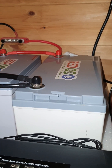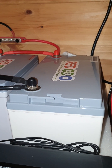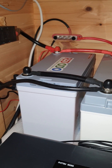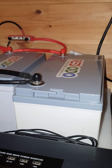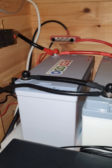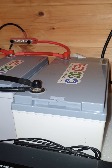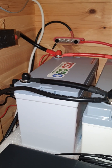One thing I've noticed running these two 100Ah batteries is that if you're using different branded batteries, the BMSs and their charging voltages can be set up slightly differently. It's better to stick with the same brand battery if you can — that's something I've discovered when expanding a solar system. I'd also recommend trying to go for a 24V system if possible.